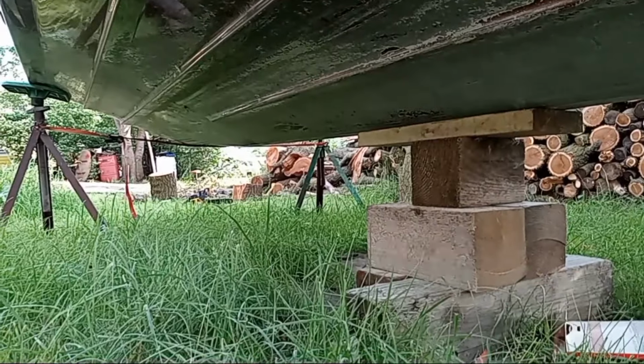Way back down there at the pickup for the jet pump, there's a crack. You ought to grind that and put a first layer on that one, and that'll be the second one on this one.